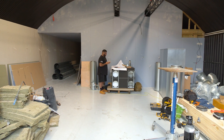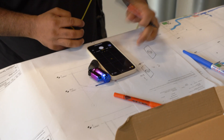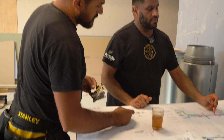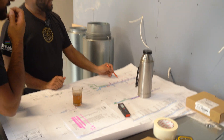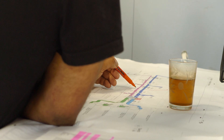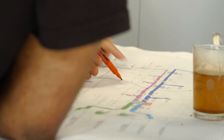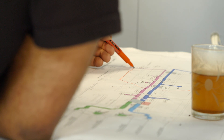Typically in commercial projects like this, clients come to us with scaled drawings of their premises or what the intent of the premises is to be. Once the client forwards us their set of drawings, we assess their requirements and overlay an MVHR layout. Design drawings are key because they dictate the size of the ductwork, the air distribution at key points, and how the air is going to be terminated. They give an indication of a material list and a full itinerary of fittings, ensuring nothing is too loud and the air is moving as quietly as possible. Obviously, when you come to site, sometimes jobs change and we adapt.